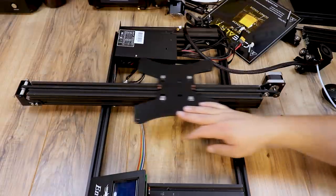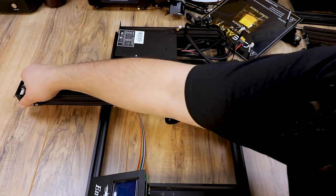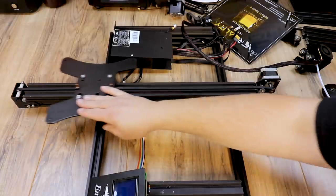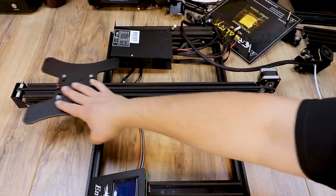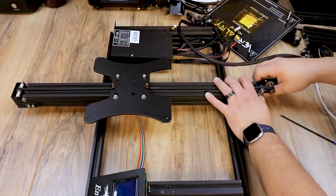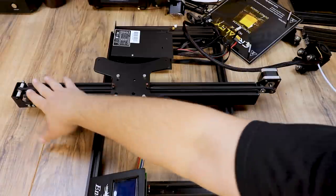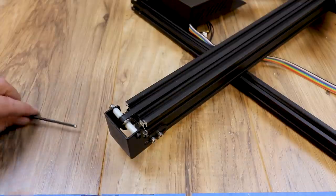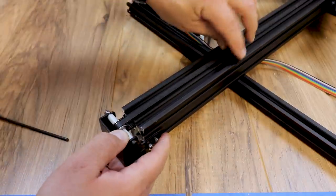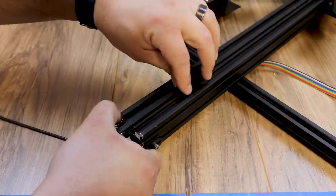The belt is secured and traveling over the top through the center of the extrusion. It's very important that everything is straight — if the motor is turned one way or another it's going to send everything off, and you'll notice that on your pulleys. Go back and forth a couple of times to make sure everything is staying straight on the pulley. Now tension it up to get a nice twang on the belt. Pull the tensioner back to get the slack out, tighten one side, then the back bolt on that side, and slide it back and forth to make sure it's sliding good. Tighten the other two bolts once you have a good twang.